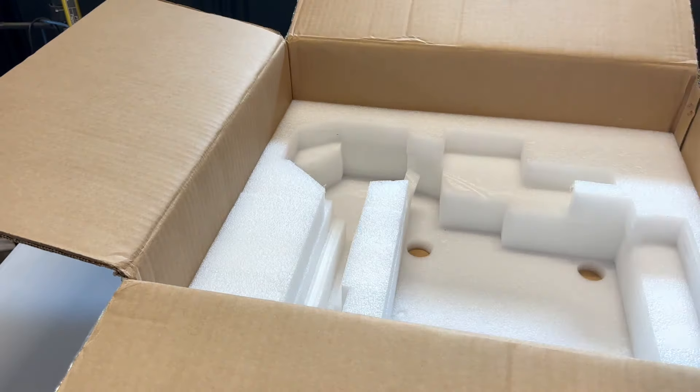We're going to straighten out the filament so it goes through the runout sensor and through this long Bowden tube. This is a direct drive, and usually you don't need a Bowden tube like this, but this is a compact little printer and I can see why they're using one. The Bowden tube is in two parts so you can actually feed it in rather easily through the direct drive.